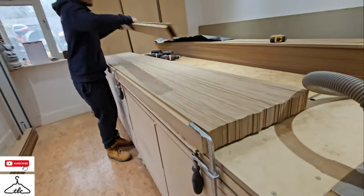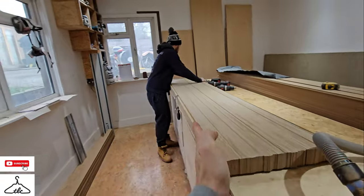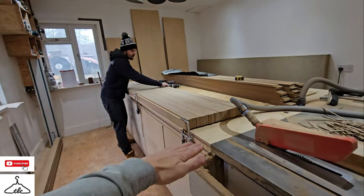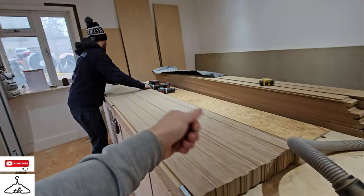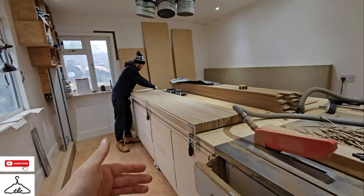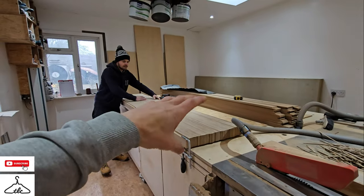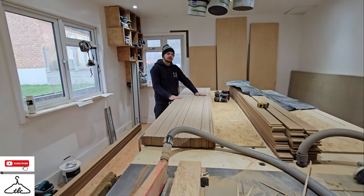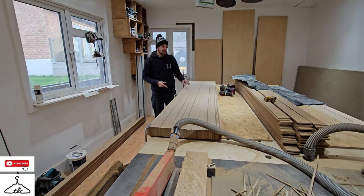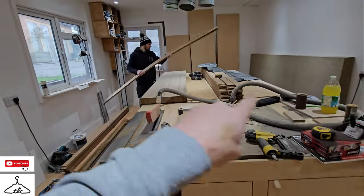Also, we've got this to help with the stacking process and to keep them level. Your bench needs to be nice and flat — we just do it on OSB so we can knock those down once he's got them clamped up; doesn't damage the bench. We know the bench is really level. So you get about 95 to 97 in a pack with 600mm clamps. That's 90 rips from 5 sheets — so he used 10 sheets and we got 180. There's your maths.